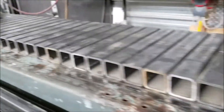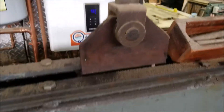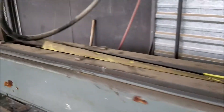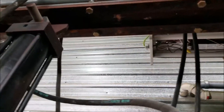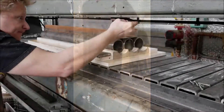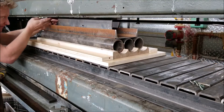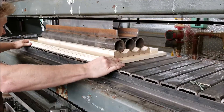The press bed is fully adjustable. I plan on making a video specifically about this press and some of the projects we've done. The upper die fits in there with those keeper plates. The hydraulic cylinders are held in by keeper plates, and I could adjust the cylinders to be side-by-side or add more cylinders in between for more tonnage. We made the press to form large radius curves on an old piece of riveted steel to make a giant table. Here I'm setting up the plates that will be held by the keeper plates in the upper ram of the press.